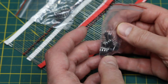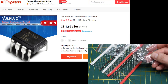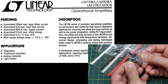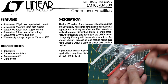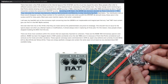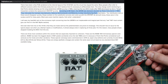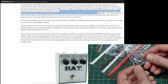This final one — I have more of these: LM308N. Again, not knowing if this is just a 741 op-amp renamed, which I can try to test for. I want to come up with a little op-amp test circuit I can drop an op-amp into and double-check some of the specs against the datasheet. If they do happen to work as expected, it would be fun to have around for swapping op-amps in and out of circuit and comparing how they all differ and impact the overall result.